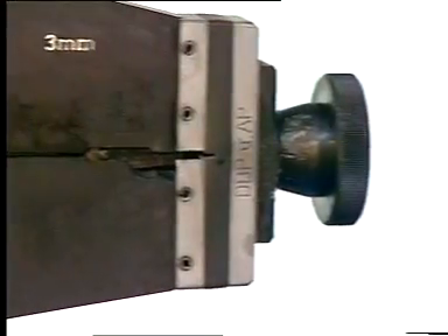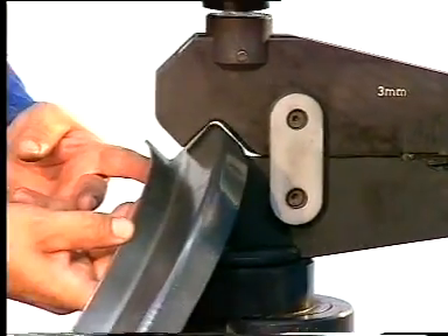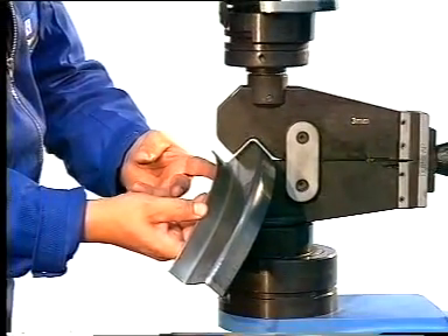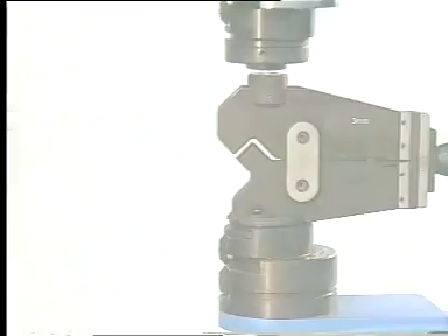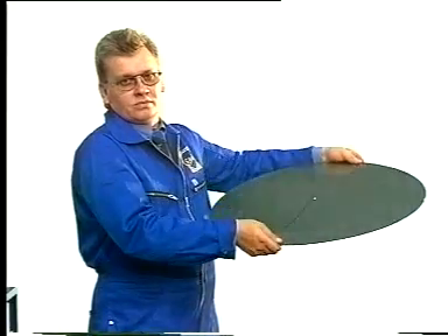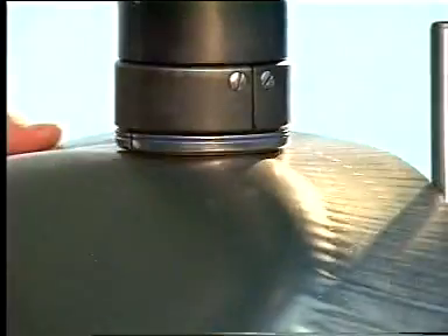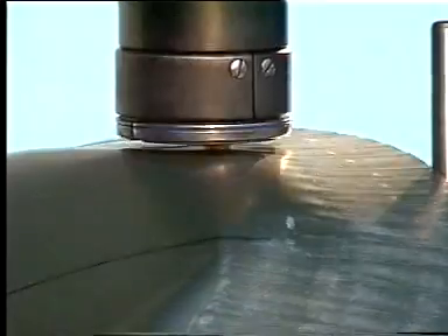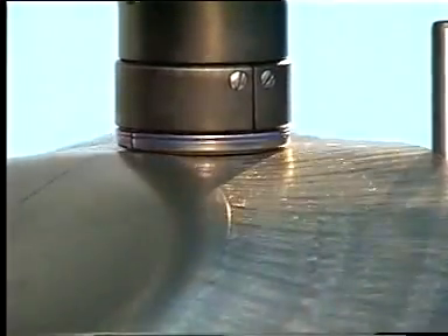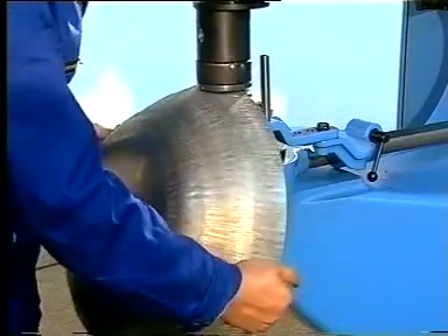This profile-former is available for a wide range of section shapes. It is, for example, used for forming the web of a Z-section profile. The next challenge: a flat sheet metal disc is formed by shrinking around the edge stepwise and at set intervals into a hemispherical dish. An adjustable stop ensures dimensional accuracy.